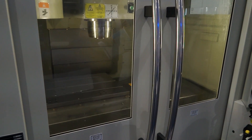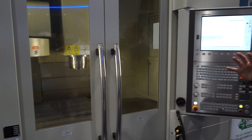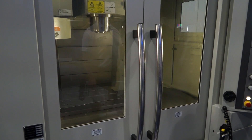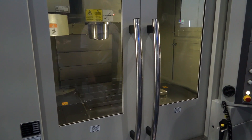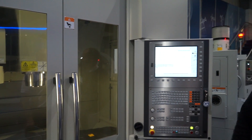I've done a bit of reading and research. I'd like to talk about the build of the machine, because lots of machining centres are available in the market, but builds vary. I notice here we've got something called an FEA casting — what does that give me? That's finite element analysis. It's a series of software run through the main casting of the machine to check for sturdiness, compensation, and build quality in the casting, and that's what gives us our end results in the machine.